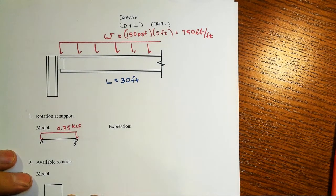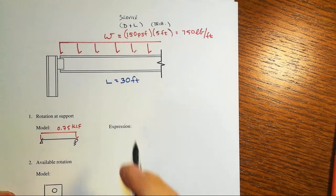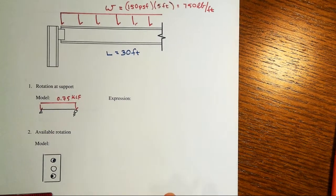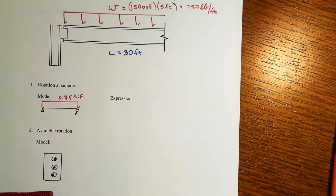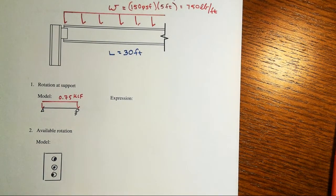And so here's the shear plate expanded out, and we've got these 3 bolts, and as the beam attempts to sag under this load, it'll rotate at the end, and that's going to shift the top bolt over to the right, it'll shift the bottom bolt over to the left, like so, and the middle one is probably going to just be in the middle. Don't really care too much about it. Right? That'll still be sort of a relatively straight line, because remember there's this clearance here that allows these bolts to move back and forth.